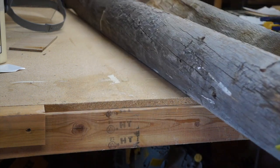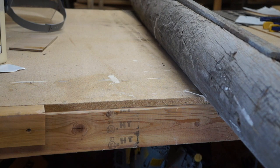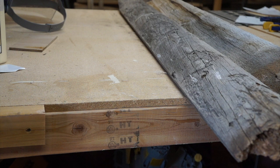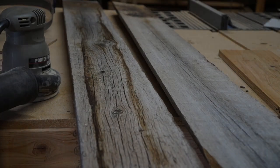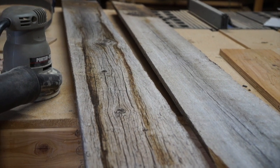I am going to sister them together to create the pole of the hat stand. I'm going to go ahead and cut some square edges to the same size and start finishing the flat edges so that it can be glued together. Now I'm just going to rough sand these insides so it's smooth and make a good contact surface for gluing.